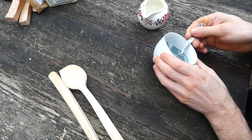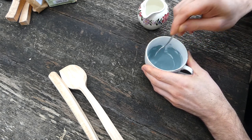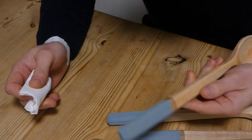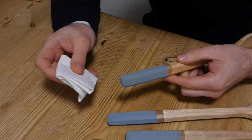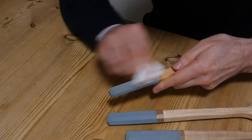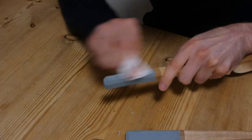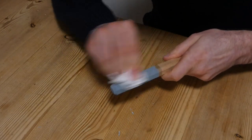I've got all the lumps out — you're looking for about double cream consistency, sort of thick cream. The great thing about milk paint is it will only take about 10 or 15 minutes to dry before I can do the next coat. Before I take the tape off I give it a rub downwards with kitchen paper, which just moves off the paint a bit and kind of burnishes it. I find it leaves a nicer finish. You don't have to be gentle — it knocks off any of the little bumps and bubbles that you get from the paint.